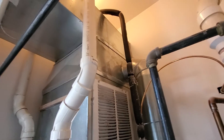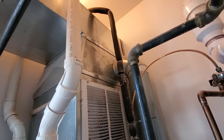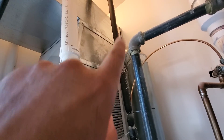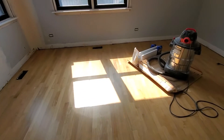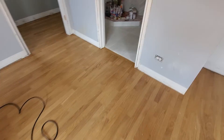The last suggestion and request the customer had is that part over there. If we can get a return into the other side of the room — where right now it's just drywall, right about here — that would be where the return would go, because there is no existing return in the room. Only a few vents here, here, here.